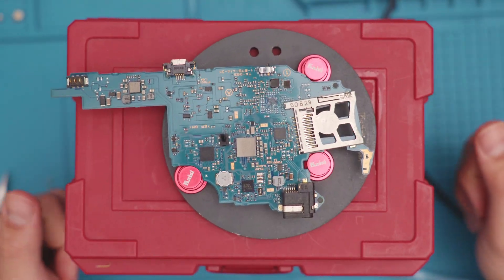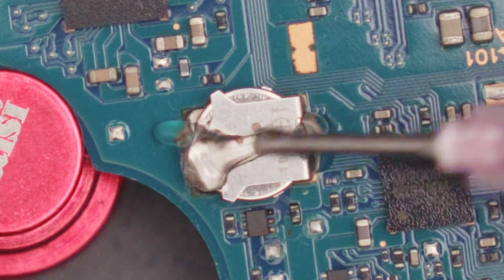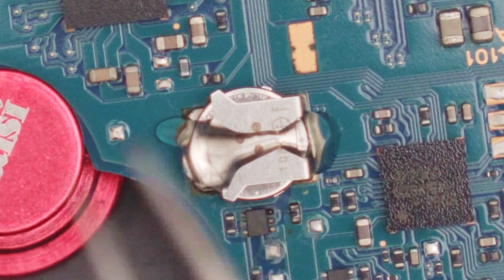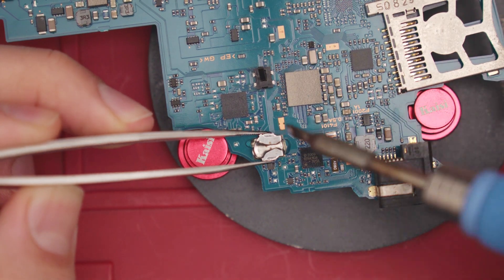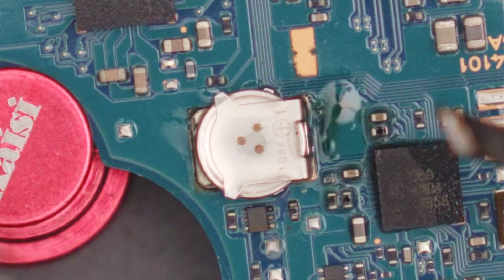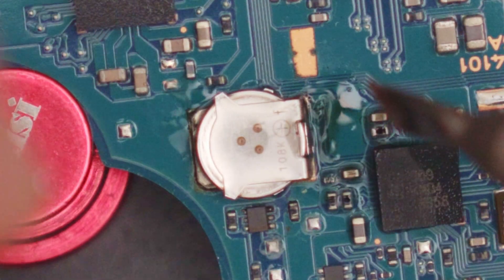And here's the final result. Finally, we have the 3000 model with its unique supercapacitor. Let's try with flux — no need to rip it apart. The ripping apart method is very similar to the other ones: you need to get under this little edge, peel one side open, peel the battery out. But it's a bit more risky as you could possibly rip the pads. So let's see how it goes if we try the soldering iron. You can probably tell it's not as easy as the other ones — both pads are actually under the supercapacitor, which is super annoying. But we're not giving up. When in doubt, add more flux and more solder.